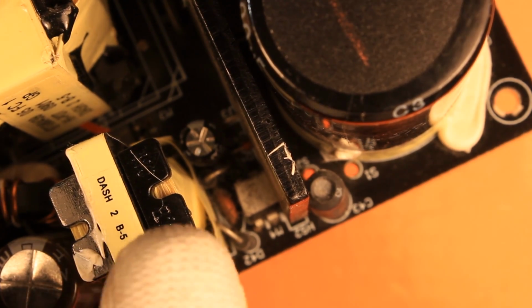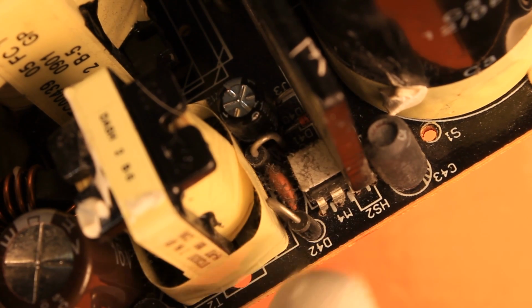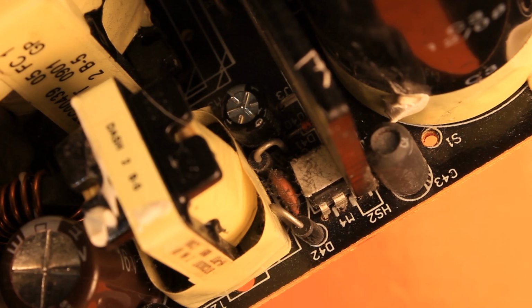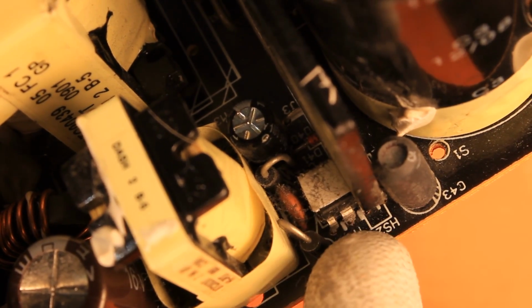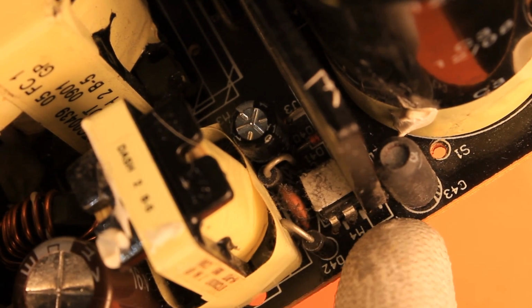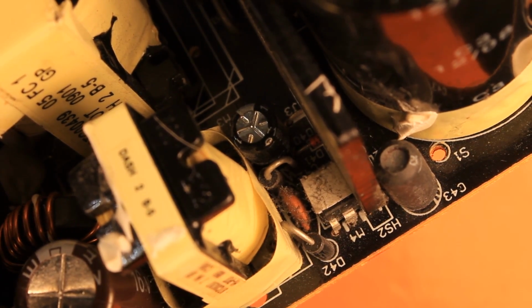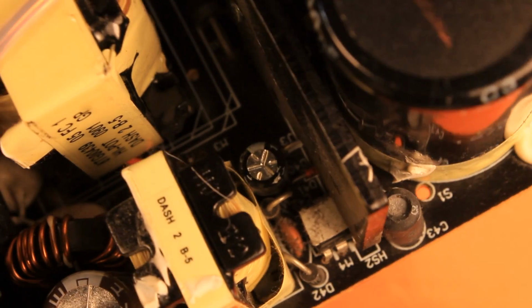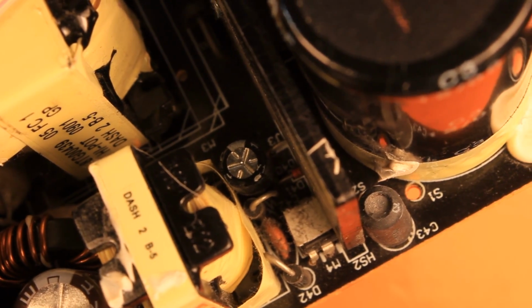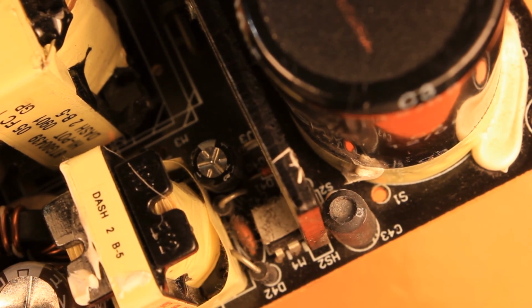The plus 5 volt small transformer is actually not even driven by a field effect transistor. Oh no, that would have been so expensive. Instead, they are using this small 8-pin specialized power DIP package, which is directly connected to 310 volt DC. I mean, just look at that poor thing. I would say this is ready to pop whenever something bad happens. So yeah, they did an awesome job trying to save the last dime on this plus 5 volt standby circuit right here.